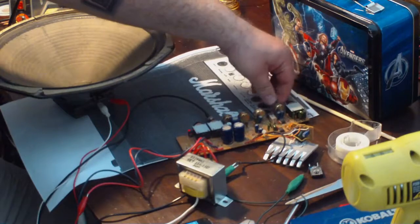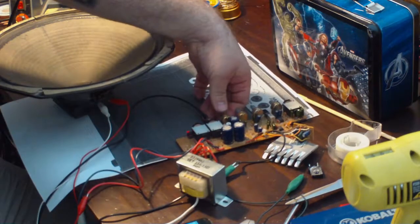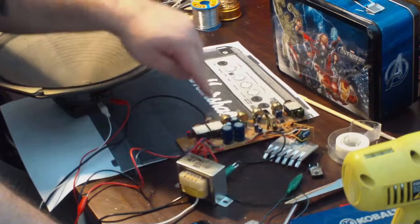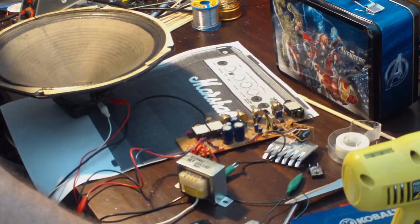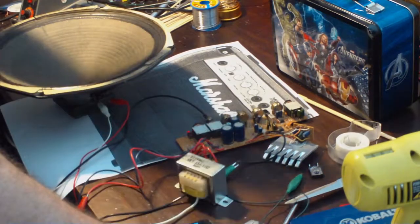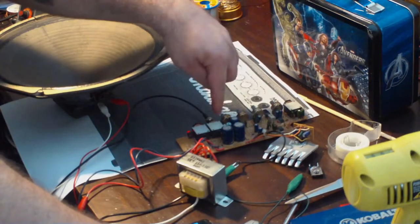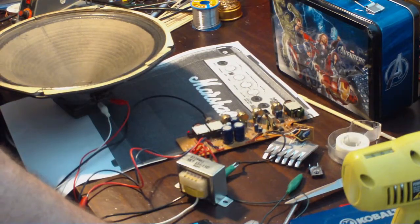There's no control over the volume on the board itself. Everything that comes in on that is going to be controlled by whatever you're doing the input on. But that's good because that narrows it down. That squeal is not coming from anywhere in the power amp section. It's coming from the preamp section somewhere. So I know at least one of the components that was put back in is not the problem. I don't know if the other one is or not.